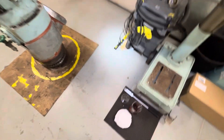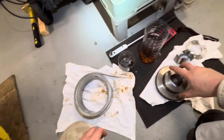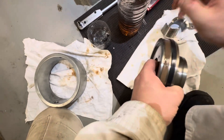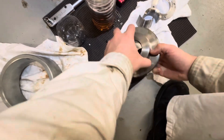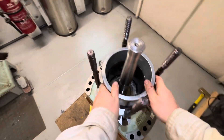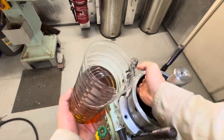Next, lower the air piston over the valve spindle down into the air cylinder. Lubricate the sealing rings and O-ring inside. Hands must be clean and oiled. Use the piston installing tool, lubricating inside the tool, to install the piston smoothly into the air cylinder. Install the special tool on top of the air cylinder and lubricate the spindle with clean oil.